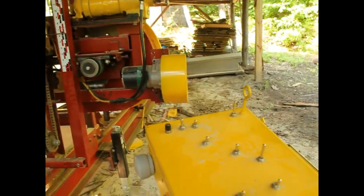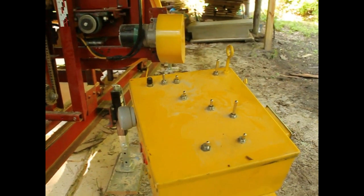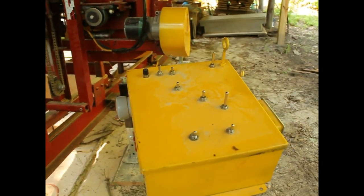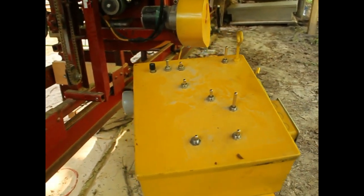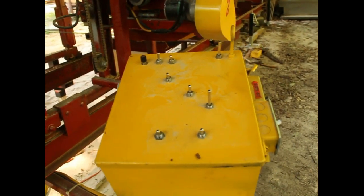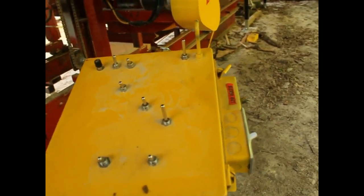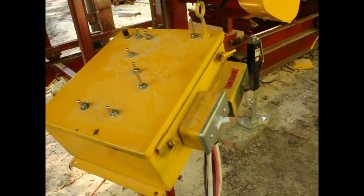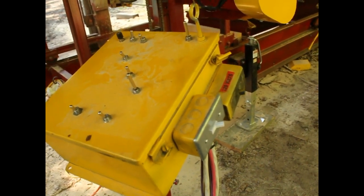And over here is the control box. It's all electrical controls. Everything on it is run by 12 volt control, and some of it's 120 volt actual voltage that we control, but everything's either a switch or run through a relay from a switch. And when we get running, I'll show you how that works. There's two 110 volt switches that kill all the 110 volt that's on the machine.